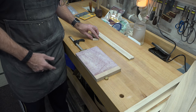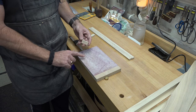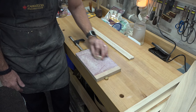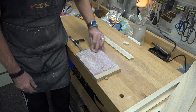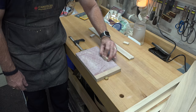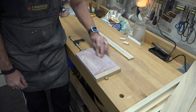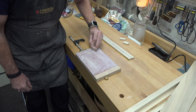Tip number one: a piece of three-quarter-inch MDF with sandpaper adhered to it using spray adhesive. A lot of sanding has to be done on pieces like this, but you don't want to change their shape or size. We're only using poplar for the frame here; we'll add other species as we go. This three-quarter MDF with sandpaper is your best friend for sanding pieces and keeping edges nice and crisp. Don't over-sand — just take off a little roughness from the table saw.